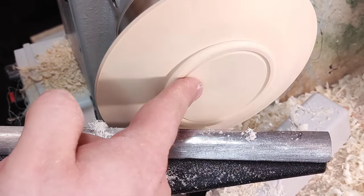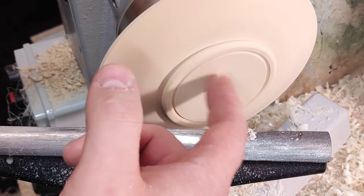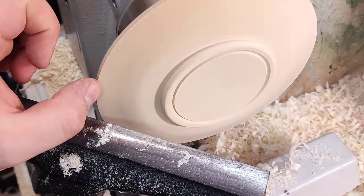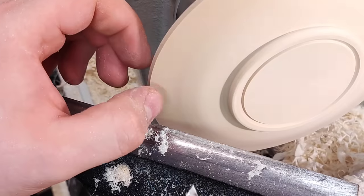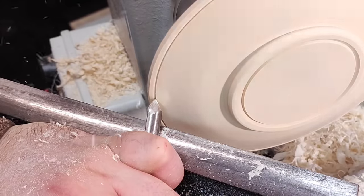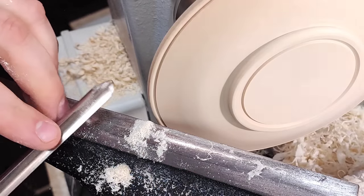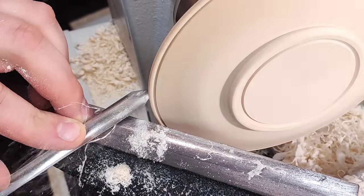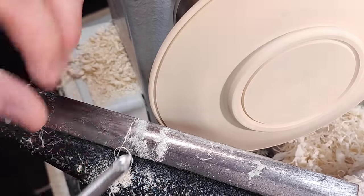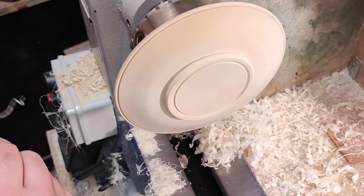The inside I'll keep like this because I still want to hollow the inside — I don't want to get too thin on the bottom. One last thing is to make a bead here on the rim. Same thickness — I'm around 4mm, so I go 4mm here, straight in, and make a bead. On this side from the bottom I shape the half-bead profile and just clean it up on the top side. That's the turning done on this part of the lid.